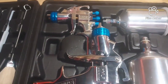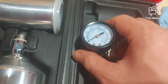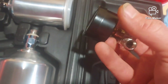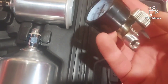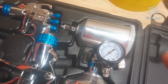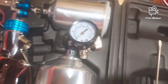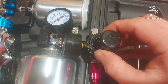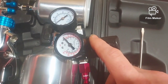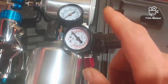Back to our air valve: it is exactly that — a valve. You hear people refer to this as a regulator; this is not a regulator. It's literally just a valve — you open it, more air flows through; you close it, less air flows through. As your line pressure changes coming from your air compressor, that is going to change as well, giving you inconsistencies in your air pressure. This is a regulator — you can see how much bigger it is. No matter what I set this regulator to, no matter what my compressor does, this will always maintain the same pressure, as long as the incoming pressure is higher than what I have it set at. That is preferred.